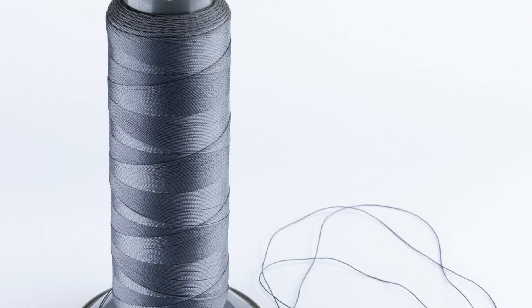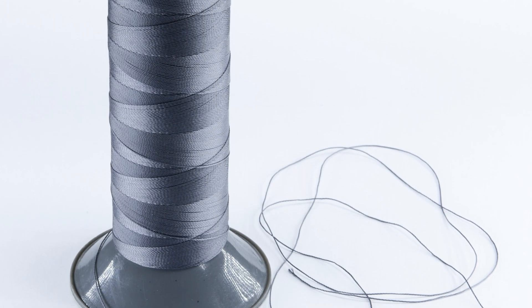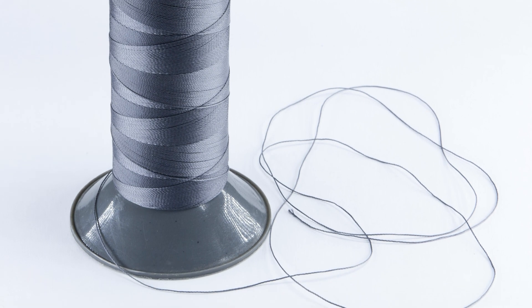Tension is pretty critical. The media serving as the screen is stretched tightly before the squeegee with ink is run over the screen. Stainless steel has less than 1% elongation, while other materials like nylon or polyester have more than 5%. So if you were to try and stretch nylon or another synthetic material at certain tension levels, it'll stretch the square openings into rectangular openings, which could tear and cause inconsistencies in your printing. This means that stainless steel woven wire is able to be tensioned or stretched at very high rates without changing the shape of each individual opening.